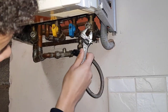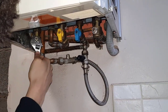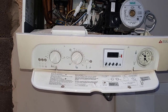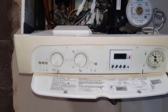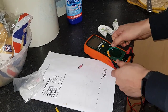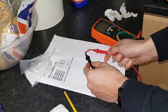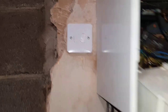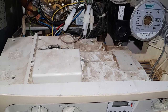We're just opening the isolation valve now. Then as I said we're going to fill up. What I did, having turned the boiler on — well, I thought it was on — but there's no power light on. So I took the fuse out of the fuse spur and I'm just going to check the fuse for continuity. The fuse is okay. The switch is on but there's no power light on here, so I'll have to look inside and check the fuses on the board to see if they've gone.